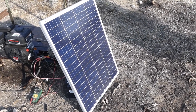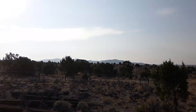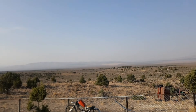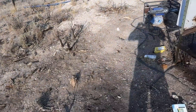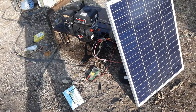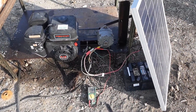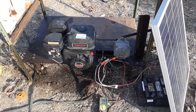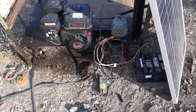It is also a very hazy, overcast day — there's a lot of smoke haze around, which is cutting down the power. On top of that, I have over 200 feet of cable between the panel and the actual battery, which is dropping the voltage somewhat.